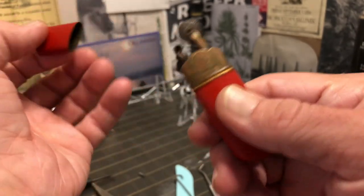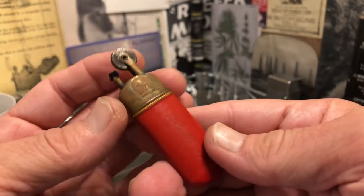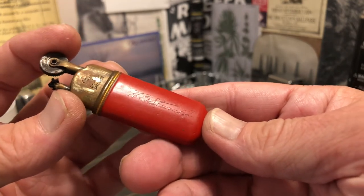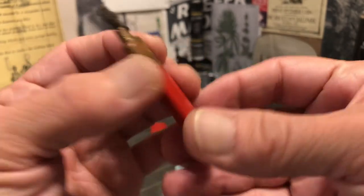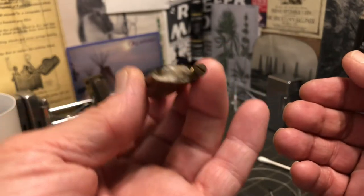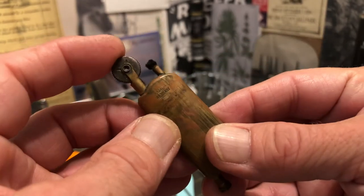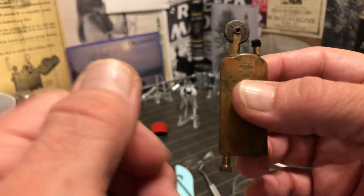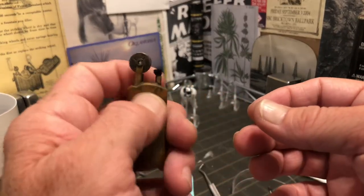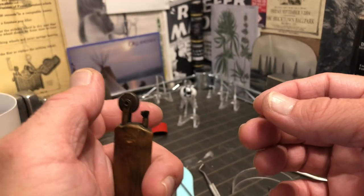It's a very light lighter. I just made the video for the Parker table lighter a minute ago and I could hardly hold it up — my hands were going numb so quick. This lighter is a little bit different, not quite as heavy, not near as punishing on my hands. You can see the insert here. When I drilled the flint tube out and got the flint in there, it was very janky. It took me a long time to get that flint grooved where I could get the spring in tight enough to where it would go all the way into the case and still spark without locking up.